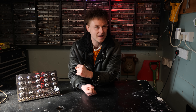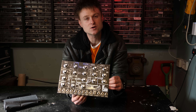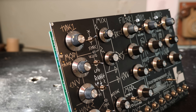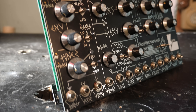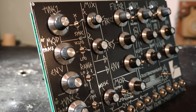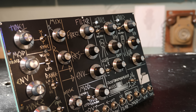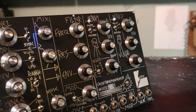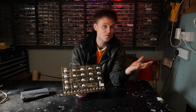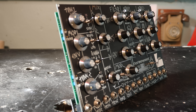It has got a little bit more complicated for a synth voice, but it does have the basic functions of that synth voice on the breadboard, including two oscillators — one primarily for music, one primarily for modulation, but they can bounce between the two. You've got a mixer, you've got noise, you've got a low-pass filter. But instead of one envelope generator like the breadboard one, it's got two envelope generators, and this also has a voltage controlled modulator function which gives you some interesting modulation capabilities like delayed vibrato, even making it sound like a game FM synthesizer kind of thing.